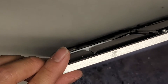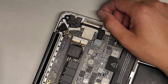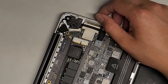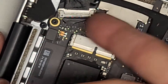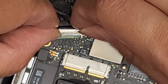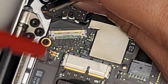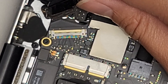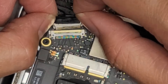Hopefully the loose cable didn't cause any damage already — sometimes it can damage the motherboard's backlight circuit. I didn't see a backlight issue because I didn't see the screen at all, so it's most likely the screen itself is completely not connected. Now we're going to disconnect the LCD connector. I get my fingernail underneath the little metal latch here — there's a metal bar there — and then I just flip it upwards. I don't see any burns or anything on the cable, so that's at least somewhat of a good sign.